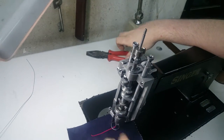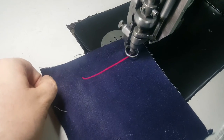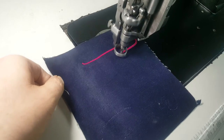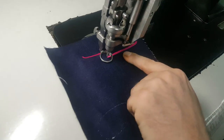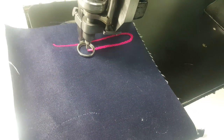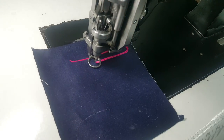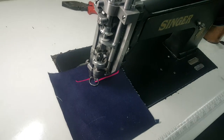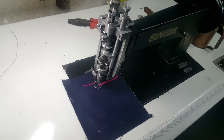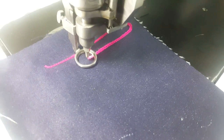We do service the machines and they do perform beautifully. Look at that — big open stitches, still using the same thread, same tension, same tension spring. The only thing we did was adjust the needle height to get all of these effects. This is where you can be creative, and this is why this particular model of machine is considered an artisan's machine. You have a lot of creative play here, a lot of adjustments, and you can create a lot of different effects. Enjoy.